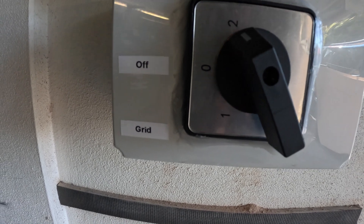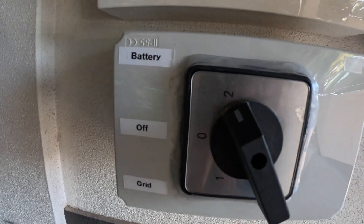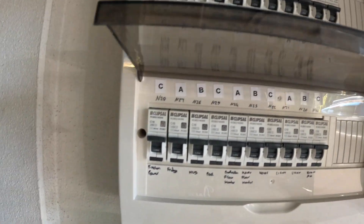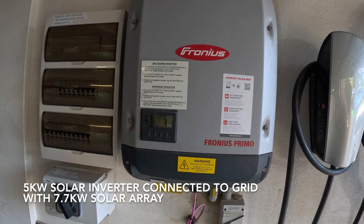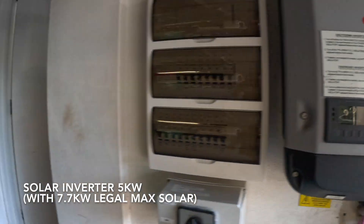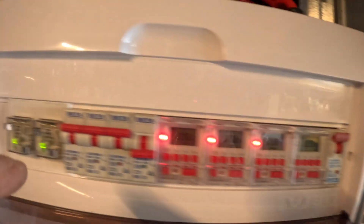I have a switch so I can run on battery power through the inverter, turn it off, and just go back to grid if the system fails, breaks, or I run out of battery. Regardless of whether I'm on battery or grid, my main switchboard is now inside my garage — standard RCDs controlling the various bits around the house. The only other thing connected to the grid is my solar inverter, so between nine and three the inverter is helping me charge the battery via these chargers.